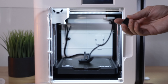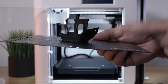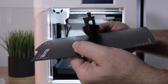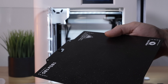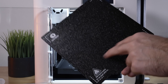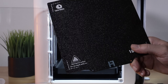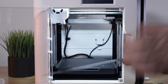The top looks great and the bottom is good too — I was a little close so there's an elephant foot, but for a 10-minute print, quite nice. The benchy stuck on well. The purge on the side pops off really easily and the print comes right off by flexing the build plate. If you have trouble sticking, try cleaning with high-percentage alcohol, or soap and water with no lotions or additives.